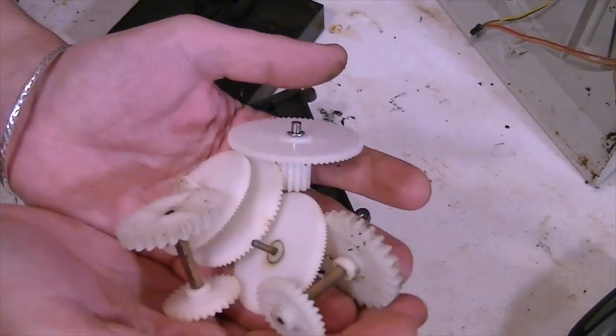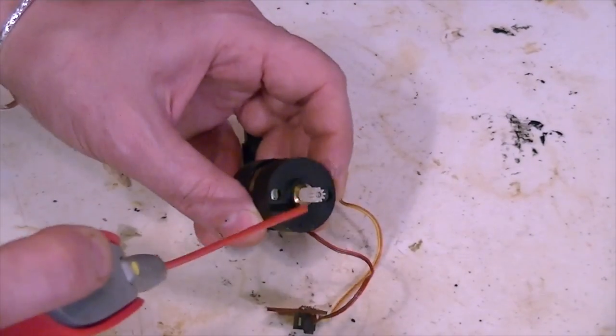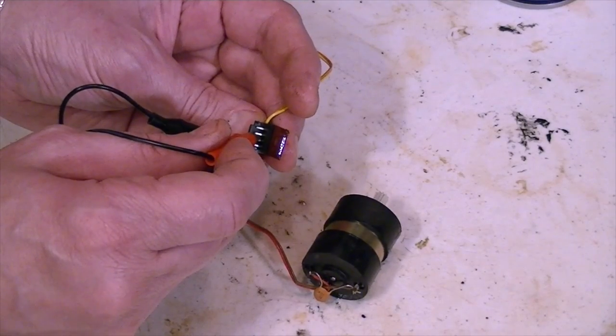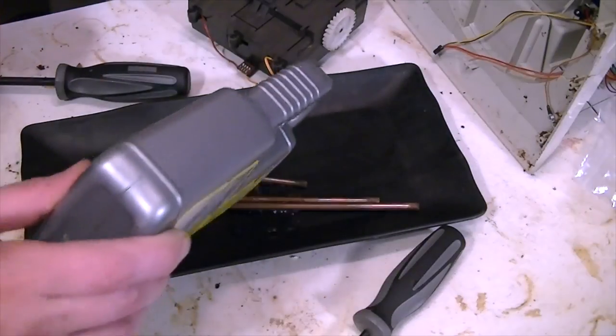The motors themselves seem to be seized up, which is not surprising for their age and having sat so long, so she was able to spray some WD-40 inside and managed to get them spinning again. In fact, here's a quick test of the motors by powering them directly. She soaked the axles in CLR for a while to help clear off the corrosion.